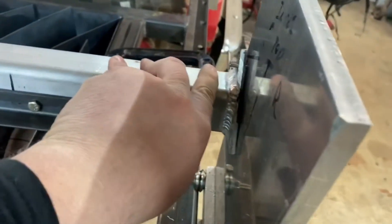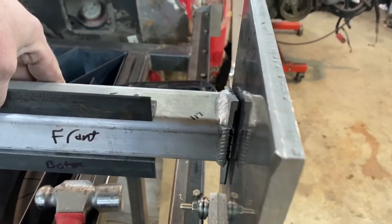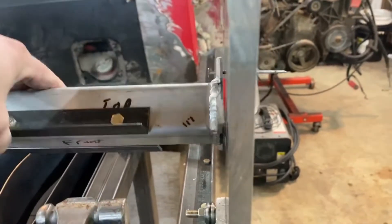I got that pinned up there — I drilled a hole the same diameter as a shingle nail and fired that through there because I didn't have anything else that would really work. A little ghetto but it'll work. While clamping it down to the side plates, I found out I'll probably need to shim — I've got about an eighth of an inch gap, give or take, just on the one corner. I might try doing that first so I'm not pulling my gantry plates in too far, because if I bind those plates up then she won't roll very smooth. I should have taken the plates off and thrown them in the drill press, because now I'm banking on my hand drilling being semi-straight. But who wanted to take all that apart — that's just too much work. I'm gonna shim up the sides and get this thing straightened up, then redrill the holes bigger and throw some bigger bolts in.